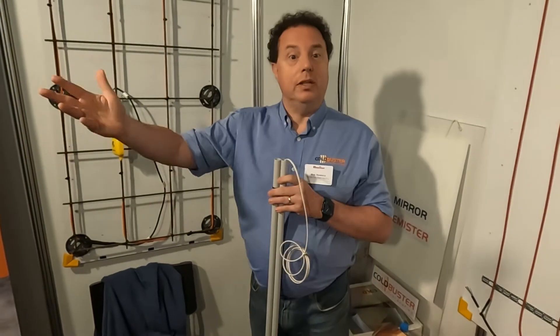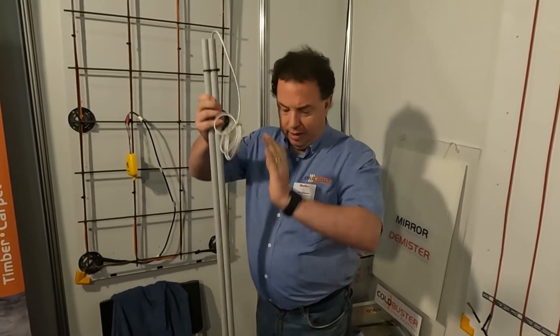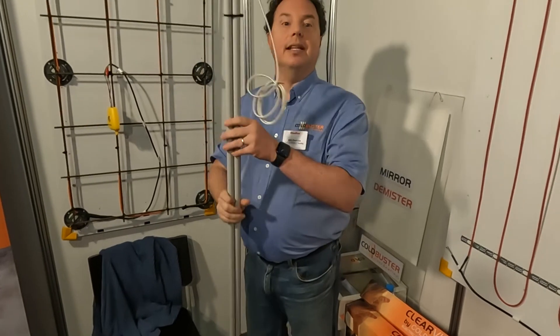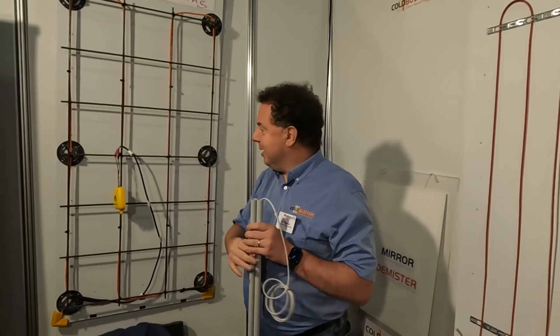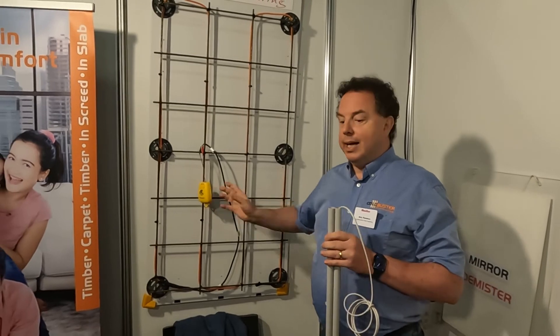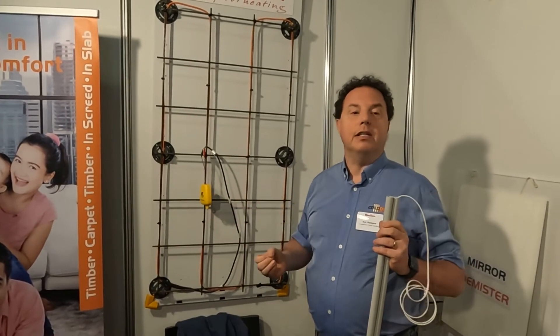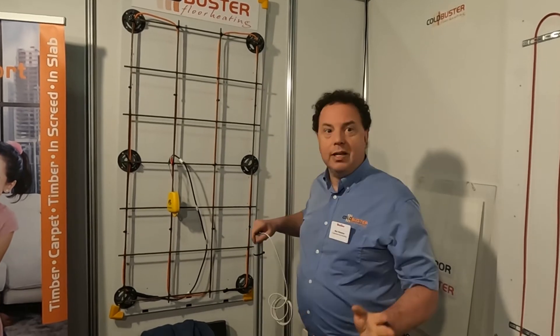We put the cold tail through, put the monitor on the end, and then lay out the heater as per our heat plan. We put the floor sensor through the other conduit, sticking out at the bottom into the floor, so it picks up the proper temperature of the flooring. That's the extent of our install. After the flooring goes down, your electrician comes back, disconnects the monitor, connects both items to the thermostat, thermostat to the power, and it's done. It's a very simple, cheap process that affects nothing before or after the floor heating — it's completely unobtrusive and takes up no space.